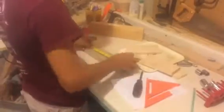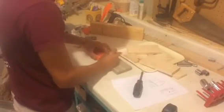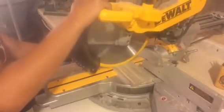Right now I am measuring out 6 inches on a 1x4 that I had, and I will cut that on the miter saw. Right now I'm taking this scrap piece and I will measure out 5 1/4 inches, so when the 3/4 inch strip that I'm going to cut out of it lays on top, it'll sit flush. I'm ripping 3/4 inch strips out of this to make the back box part so the knocker lever has room to move.